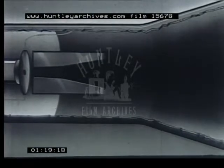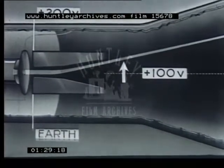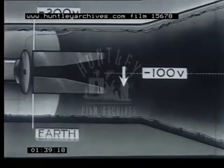Consider one pair only, with the upper plate at a higher or more positive voltage with respect to the lower. Since an electron tends to move in the direction of increasing positive voltage, the beam is bent upwards. When the upper plate is at a negative voltage with respect to the lower, the direction of increasing voltage is towards the earthed plate, and the beam is bent downwards.